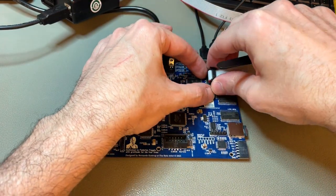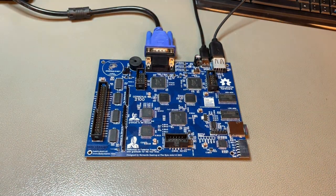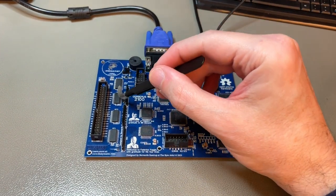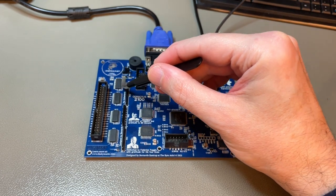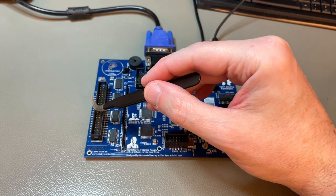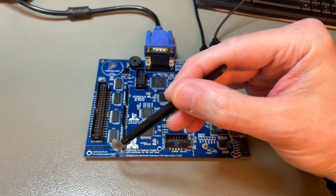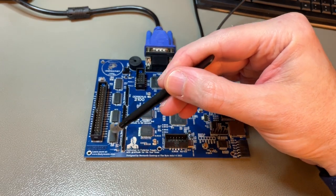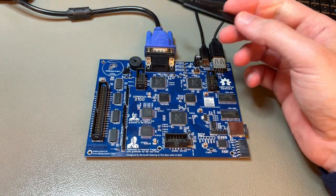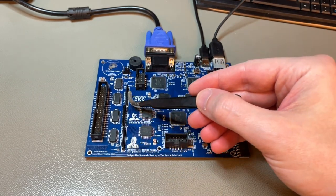That's the point — to allow you to play with the hardware configuration itself. These chips are a buffer and three transceivers, used to provide drive and tri-state mode for the expansion port, keeping it isolated from the computer without loading the buses. These three bus transceivers and one buffer are all tri-stateable. These resistor banks are 10-kilohm pull-ups for the address and data bus.